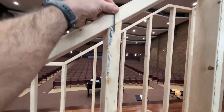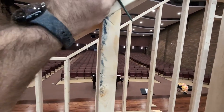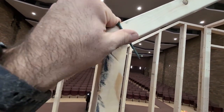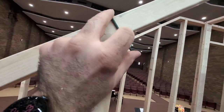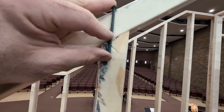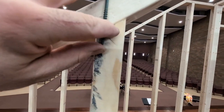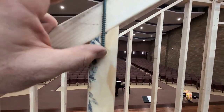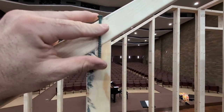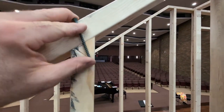I don't necessarily screw straight down into the end of them, because this is how much engagement you get, an inch and a half, when it's normal to the face. It's going to be hard for me to show this. It's like right to there. But when you swing over to straight, this much more of the screw is consumed before the second piece is engaged. So basically, you have far less threads into the second component because of the fact that we're trying to line up with it.